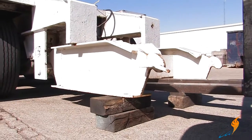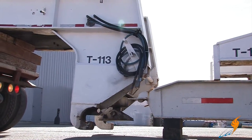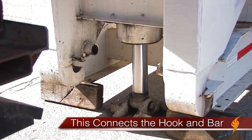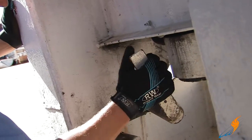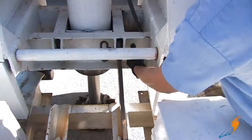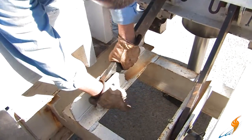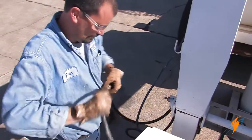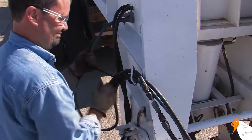Block the coupler to achieve an 8 to 10 inch height. This helps when adding the gooseneck. Connect the gooseneck to the coupler by guiding it in with the truck, and then raise the ram once it's lined up to the coupler. Once it's lined up, install the safety pins. Drop down the supports and install the safety bars. Finally, connect the air and light cords. Make sure that they are secure so they do not drag on the ground. At this point, the gooseneck and axle is ready for transit.